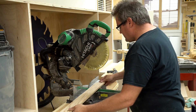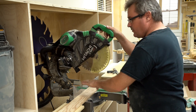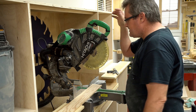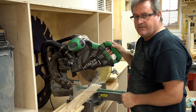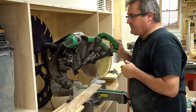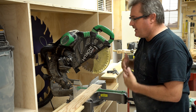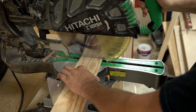The next thing I'm going to do is make a cut clean through, leaving about four or five inches on the other side, and go all the way through in one swipe. The key to using a miter saw accurately is to not wrench it from side to side as you make the cut. You want to hold it — not loosely but not overly tightly either — just make a smooth, even cut right down through the wood without moving it around. It's the moving it around part that kills the cut. You hear people talk about the inaccuracy of these saws, but think about a hand saw — that's free in your hand. You have to have a little bit of experience and skill to get absolutely perfect cuts.